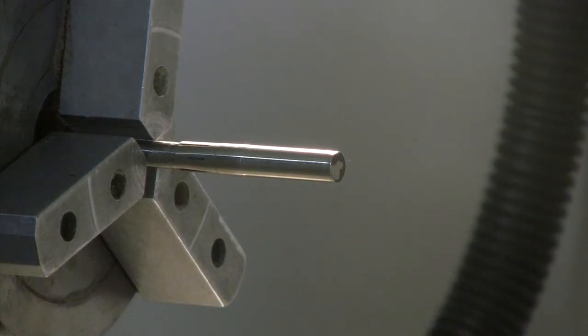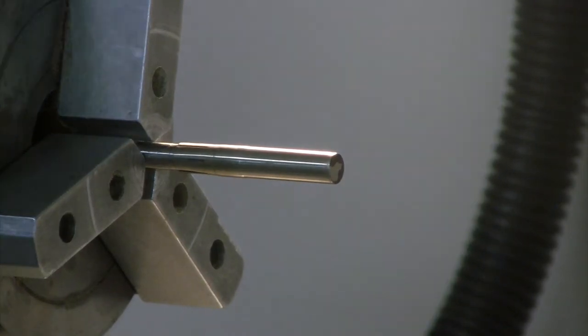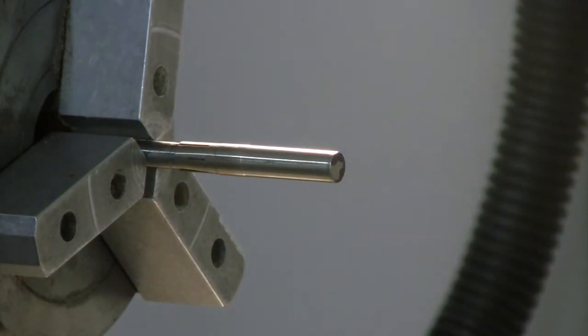I can feel it now trying to get on. It probably needs about 3 more 10,000ths removed. So I'm going to keep switching up some nice fresh paper. There's a nice long piece here. Excuse me if I got in the way there. And here we go.